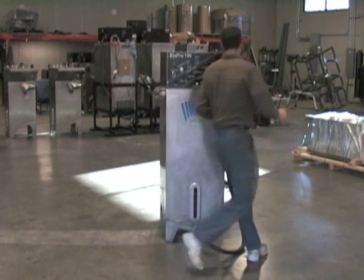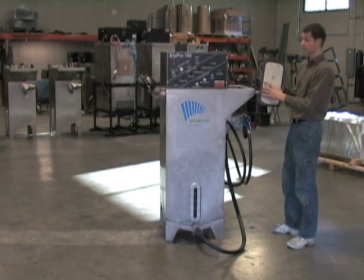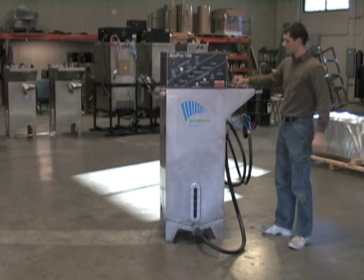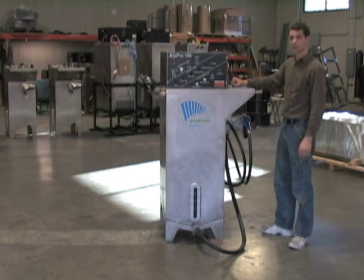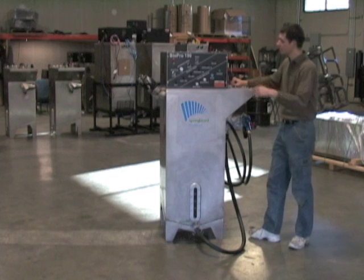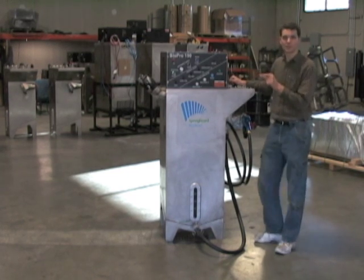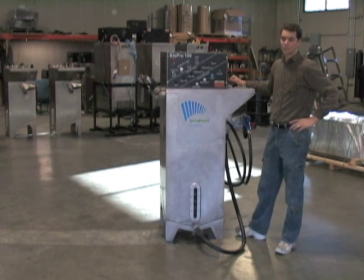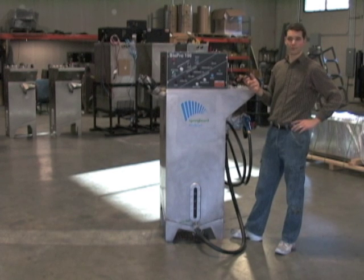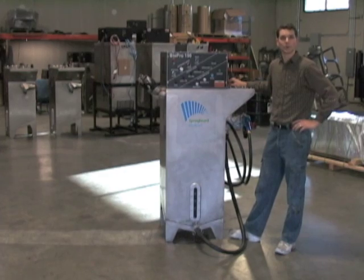Also, the main lid right here — it's heavy, it's weighted down with a quarter inch plate of stainless steel. It's got a gasket all the way around that seals tight against the machine. This main cap for the machine body is also a gasket seal. To demonstrate how good this machine is at preventing methanol fumes from escaping, we're going to use our demonstration machine and stuff it in a closet. We have a device that reads methanol vapors and flammable vapors in parts per million, and we're going to monitor how many of those vapors are able to build up in that small closet.